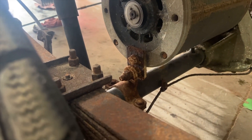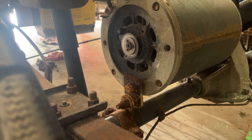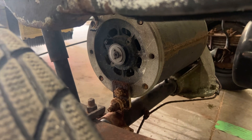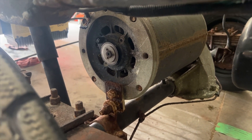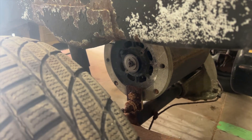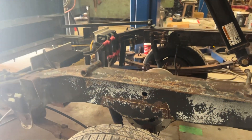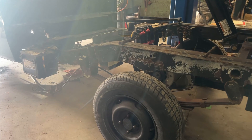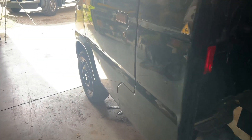The cover is off of it, but all it is is an optical encoder. The symptoms were exactly like the controller didn't know what the motor speed was. I've identified the manufacturer and I do have a replacement on order — should be here later this week.